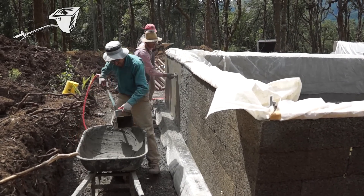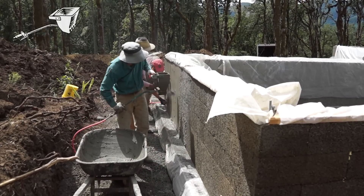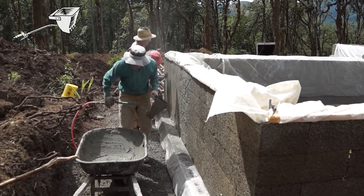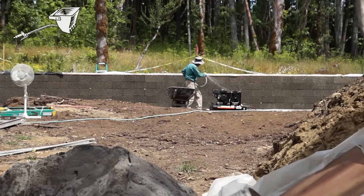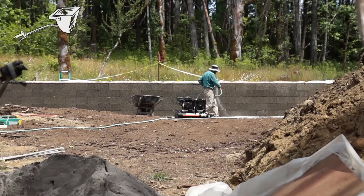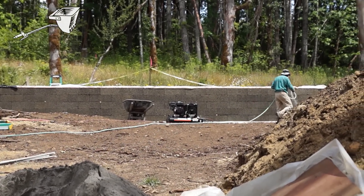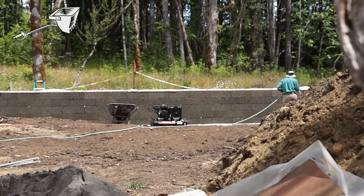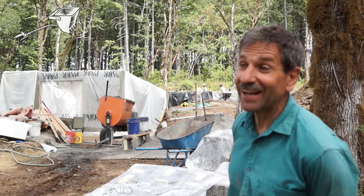For this product, we really had to wet down the wall. In other products, that may not be as much of an issue, but this porous product just sucks up the water really bad. If we didn't wet down the wall — in fact, the first time we put a coat on, we didn't wet down the wall, and it just sucked it up so fast it just didn't work. So we learned, it worked, and I think they're almost done.